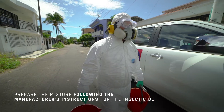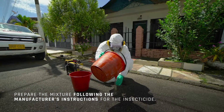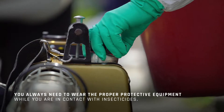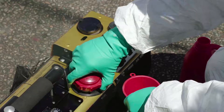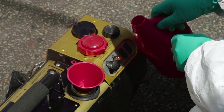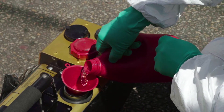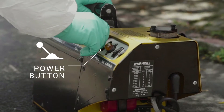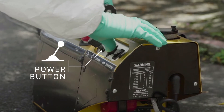In preparing the mixture, always use a funnel with a filter to prevent particles from entering the insecticide tank since they can clog the filter. Once the insecticide mixture is ready, it should be put in the tank. When you fill or refill the fuel tank, the machine may be hot, so make sure that no fuel leaks have occurred since they could set the machine on fire.